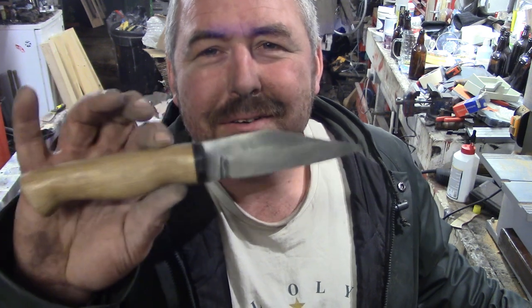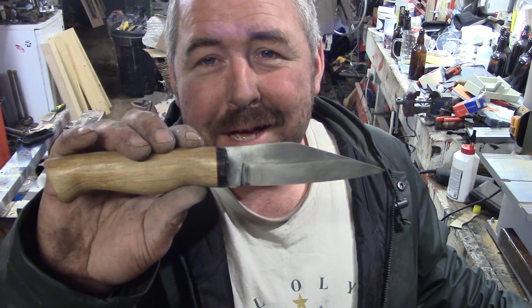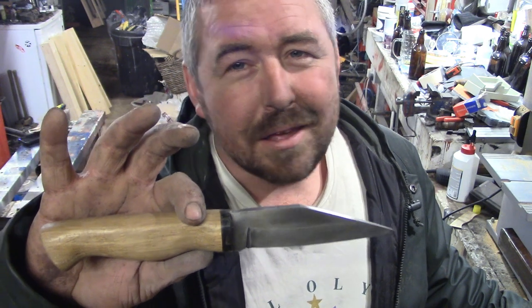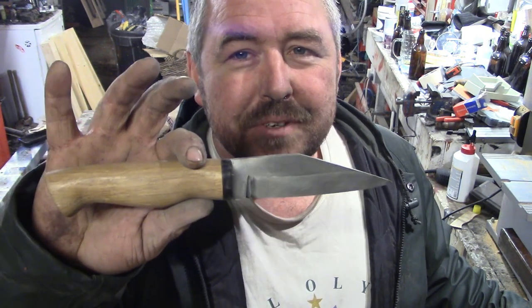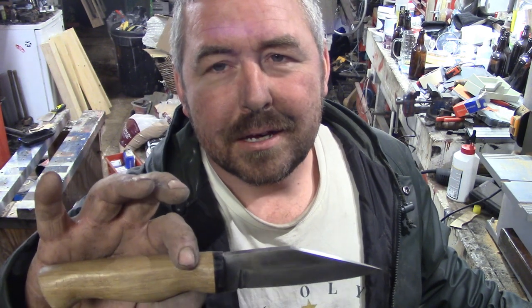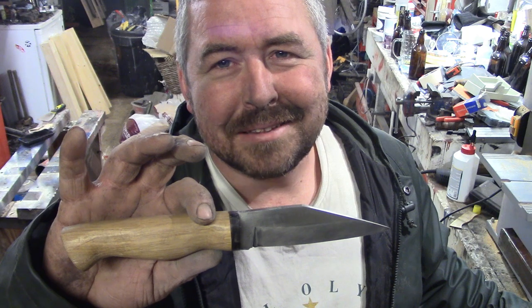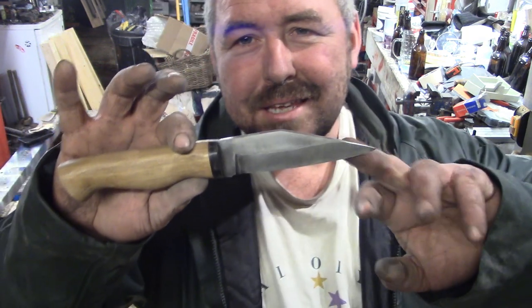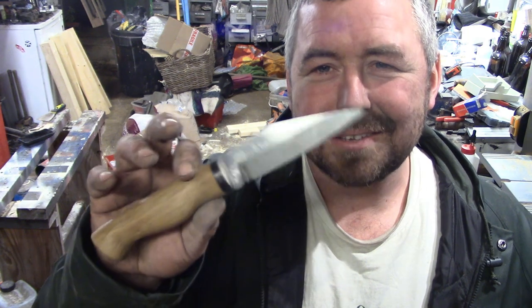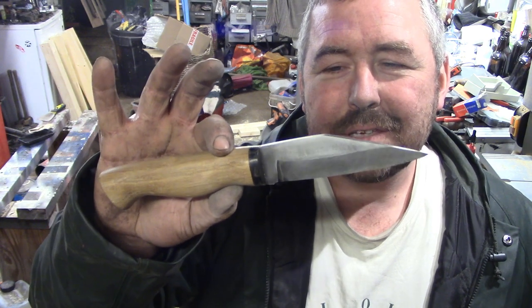Yeah, I've made quite a few mistakes, so a few of my experiments haven't gone too well. What has gone well, it's probably going to be a useful blade shape. Unfortunately, putting it in that stainless envelope, I think that's a very promising technique, but it really wants to be done in an oven or an enclosed gas forge where you're guaranteed through heat throughout the lot of it. Using the envelope and a big blowtorch has left the tip very soft, which is a bit of a pain, because that's kind of the reason for making a knife shape like this, because you get a really useful tip out of it, don't you? It'd be good for carving, but I've just been flicking a bit of wood with it, and it's just knocked the tip over,